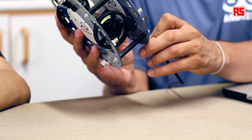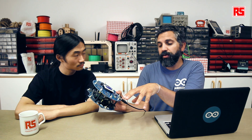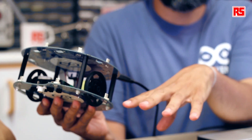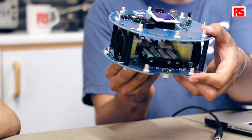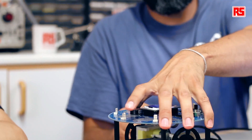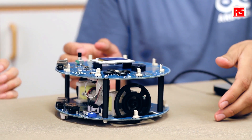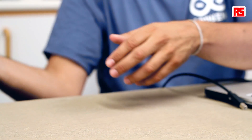Now the software is in the robot. As I explained, when you plug in USB power to the robot, the motors are blocked and it will not move. If we unplug this and just turn the robot on — see, it's moving forward, stopping, moving backwards, stopping, turning, stopping. You just put it on the table and Jun might have to help you stop it running away. Turning, turning again, turning forward. For this reason we need to block the wheels so the robot doesn't run away.